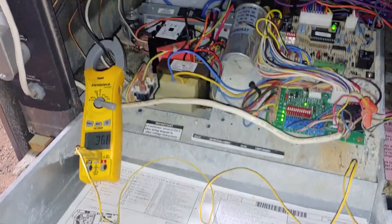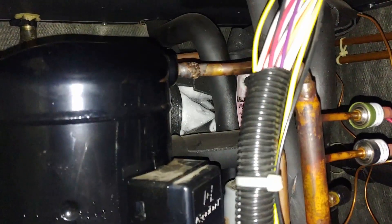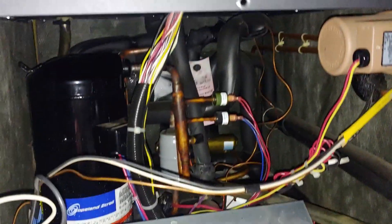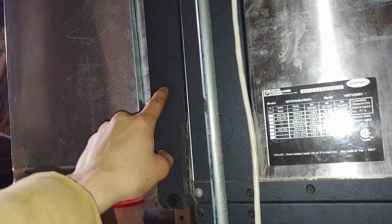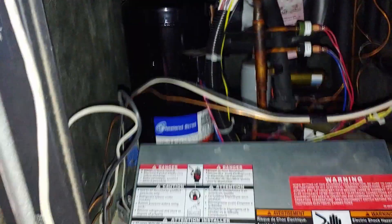But yeah, looks like we got this one taken care of — just low water in the loop field. You can see the compressor has warmed up considerably; now there's no frost on it. The water heat exchanger back there is slowly melting off too, and we've got nice heat on the lineset or on that coil up here. I actually replaced this coil at one point — link in the description to that video if you want to see that. But yeah, looks like we're good to go.